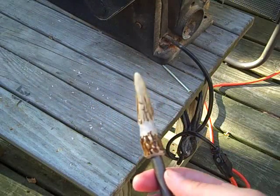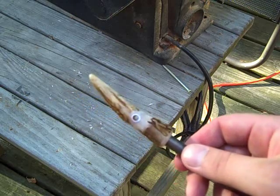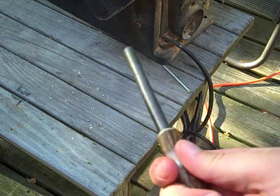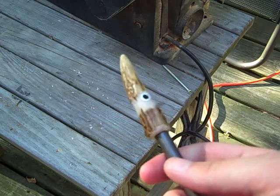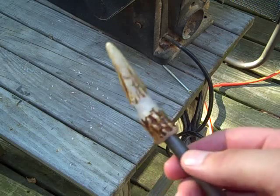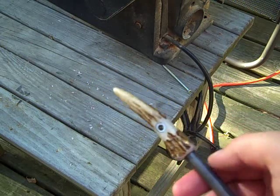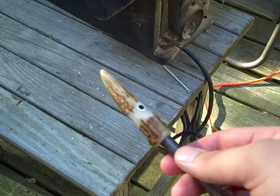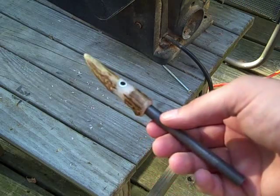Alright guys, here it is. I ran that ring right around it where the lanyard hole is — makes a nice grasp. It's still gonna cure overnight. I did the quick emulsion and Danish oil so it soaks into the antler and prevents any cracking from moisture. I'll probably do a couple more coats tonight just to make sure, and I'll take some stills. Thanks a lot guys.